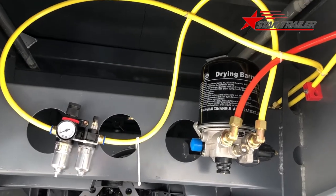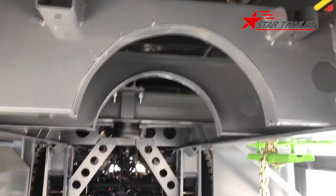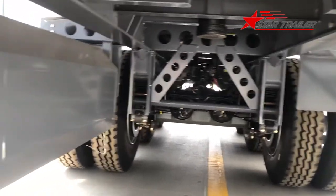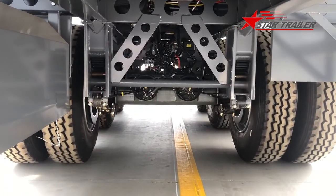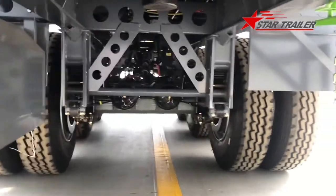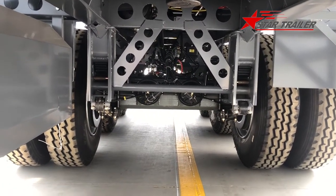These are the devices for the braking line. We have it here. This gap, we leave it for the water tank. In China, they put a water tank to reserve water and spray it onto the tires in summer, or even when the brake drums get too hot. They drive in mountain areas and brake quite frequently, so they use those water tanks with pumps to spray water onto the wheels.